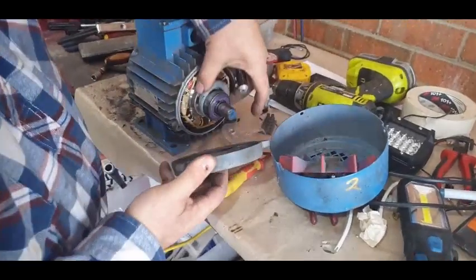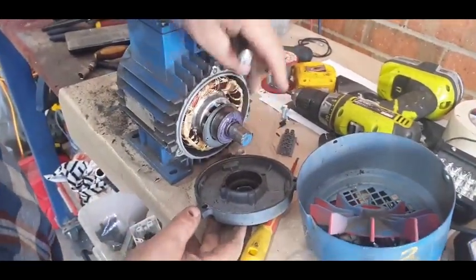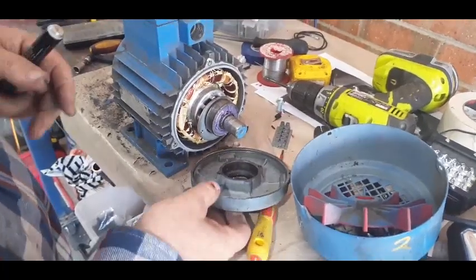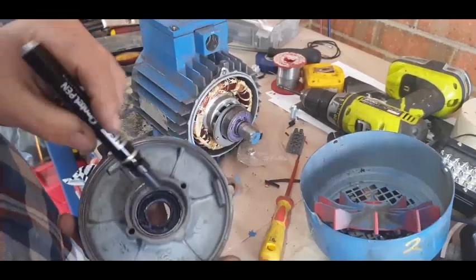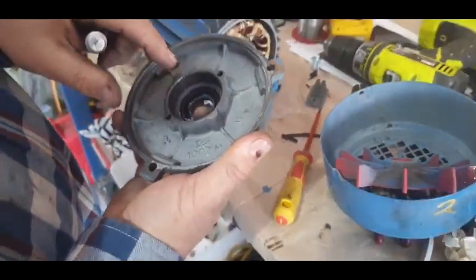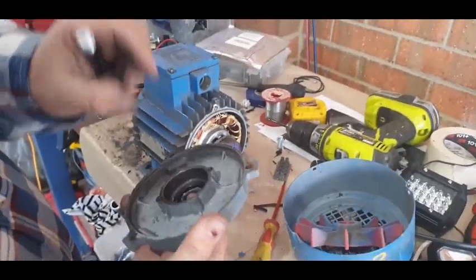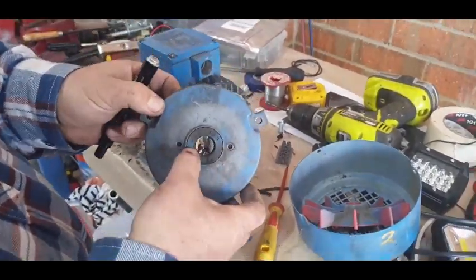This also had a bearing backing plate behind it to help hold it on. The bearing sits in here, and you get a very dry grease — not oil like you'd find in a car. The grease is made to hold on. There's a backing plate that holds on here, and you'll notice there's a plastic seal in here too, so it sits around the shaft. Because the shaft's moving a little bit, it's not rubbing against steel — it's actually rubbing against the rubber seal.